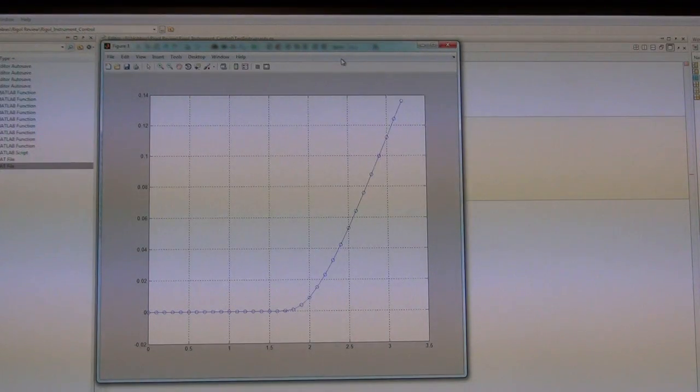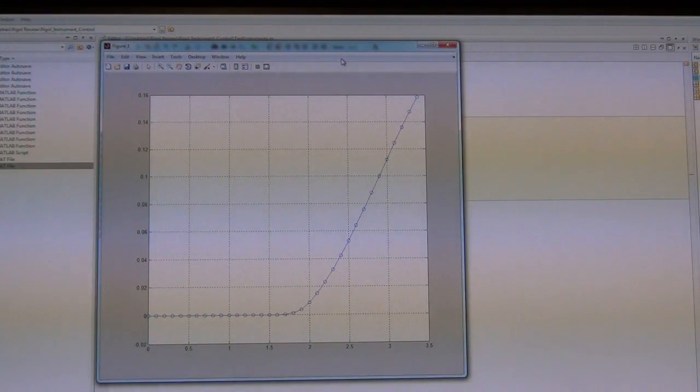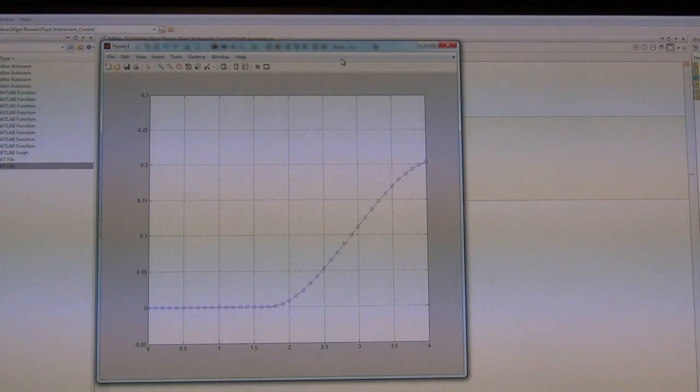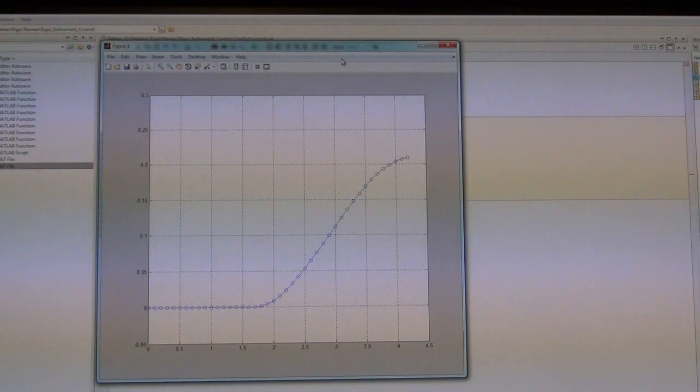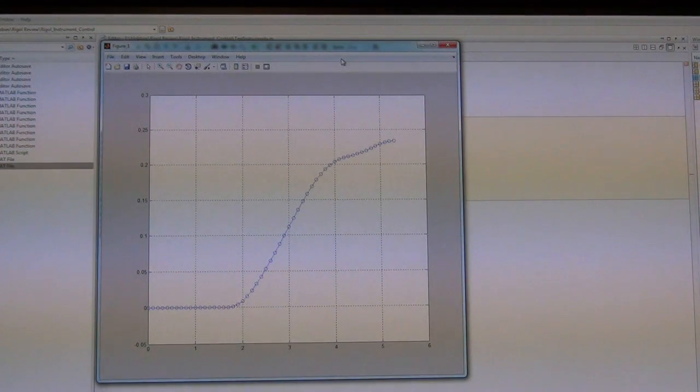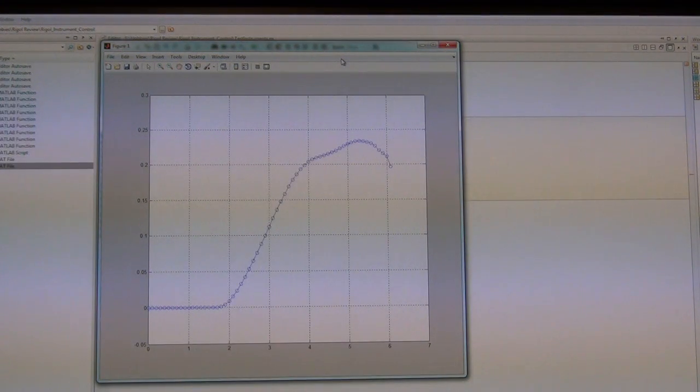The yellow LED is now completely orange, and the current is going up. Wow, now 100, 200 milliamp. Oh, it's flattening out. I think the LED is finally giving up. You can see the curve is continuing on. The current started to go back up again. 233, very steady. The LED is now very dim, and the current, you can see, is about to drop. Let's see if it completely collapses.